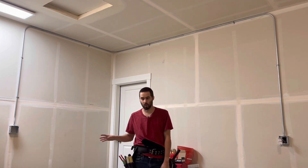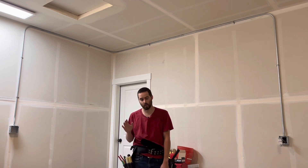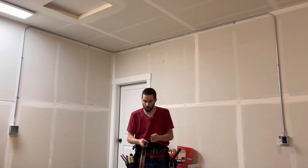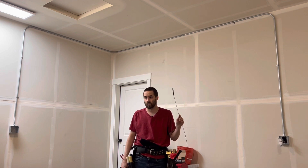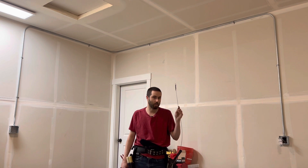It's a basic way to pull wire or string. There are other methods, like using a vacuum and a string, or a little mouse as they call it. But today I'm going to show you how to use this fish tape. Basically you just unroll it.